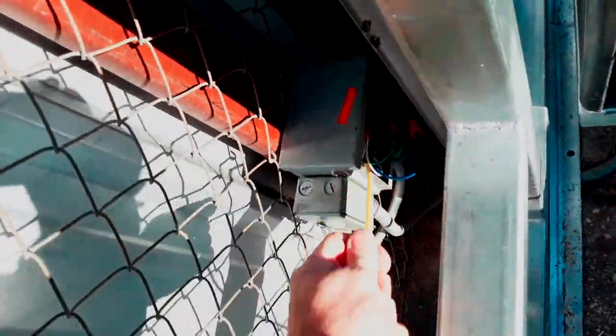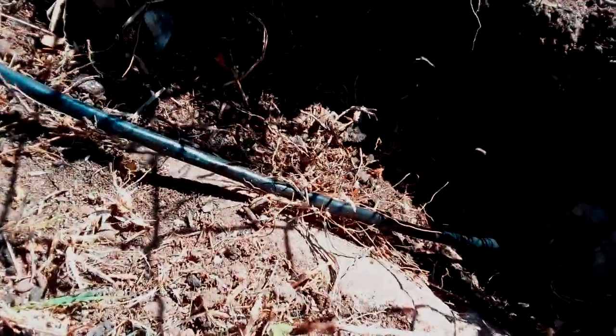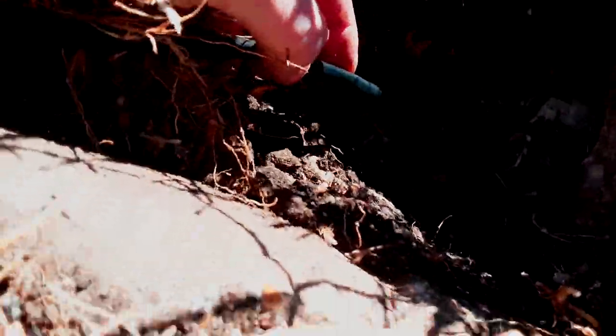I finished taping it. Now I'm going to go over to the other side and pull it. It might get caught on that first taped part, but I think we've got a good angle to get past it. We're pulling some dirt in there too, so that's causing a little bit of an issue. I'll blow it out one more time. Now I'm pulling it straight — not at any angle — straight right along with how I'm pulling. If I had the wire out to the side, it would have to make that bend coming in, and that's not what I want.